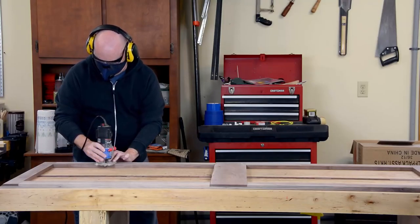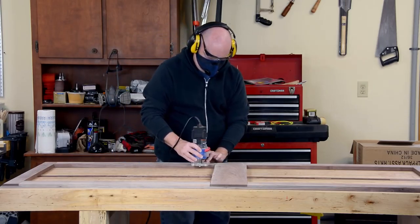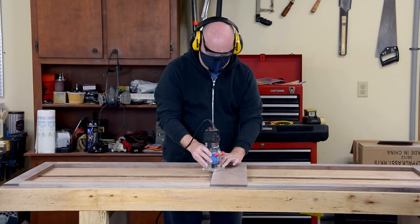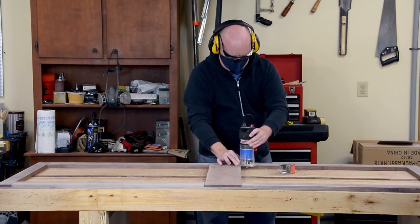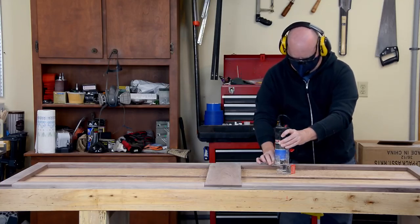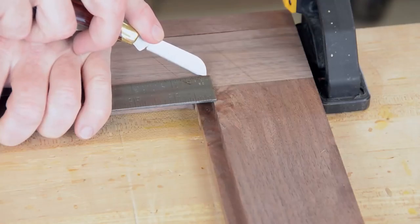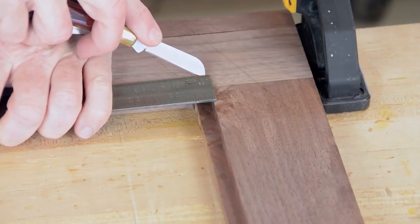Since I was already cleaning up a mess from a router with no dust collection, I figured I'd go ahead and put roundovers on most of the exposed surfaces, at least the ones that I have built so far. This is a tiny roundover bit — it's only 1/8th of an inch, but it's enough to get rid of the sharp corners. Sometimes we want sharp corners though, like in these rabbets, and the router bit being round doesn't do that for us.